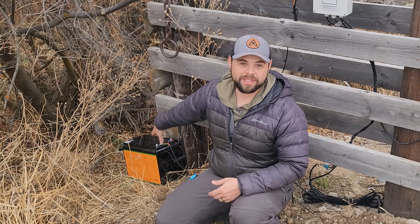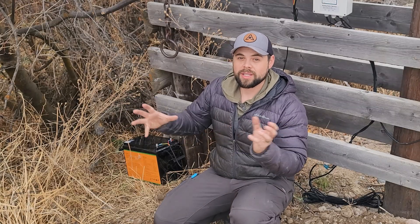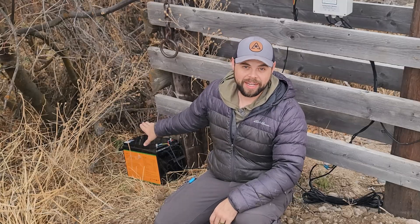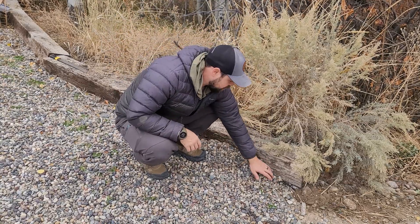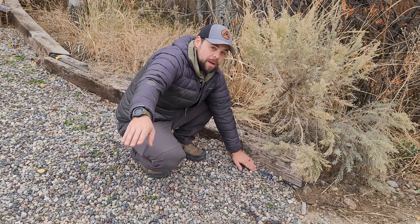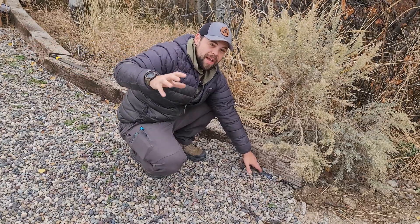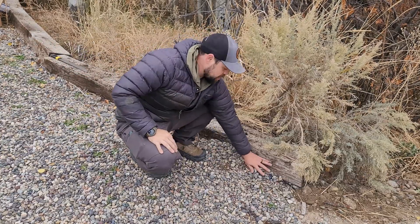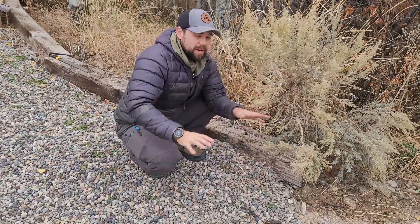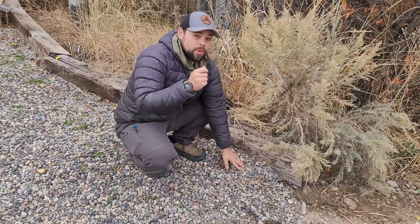This is not its finished setup — I'm going to be burying it inside a cooler for insulation and it will be underground after today. There's also a special exit wand underneath the gravel here. It reaches up to 12 feet away and uses a magnet, so when it senses iron passing by or gets enough vibration, it will open the gate so vehicles can exit without needing a key fob or keypad.